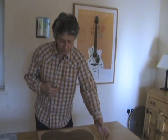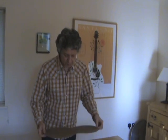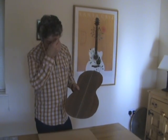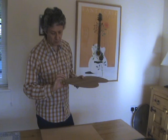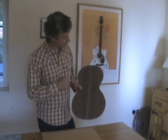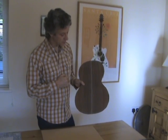One of the things that I've done is chosen the wood for the parlor guitar. For the back and sides I'm going to use Claro Walnut from California. Here you can see the back — the two halves have been joined, taken down to a thickness of about 2.5mm. And I've been laying this marquetry strip down the centre of the back.